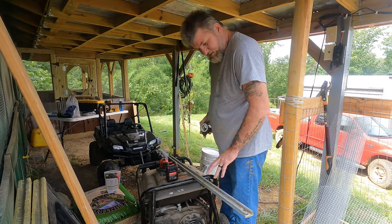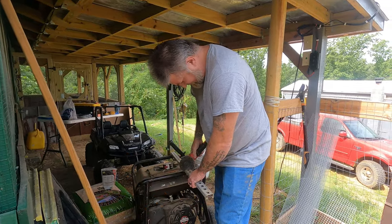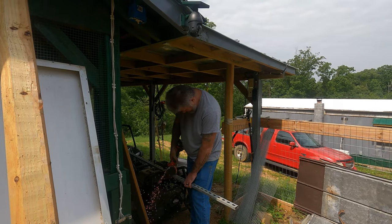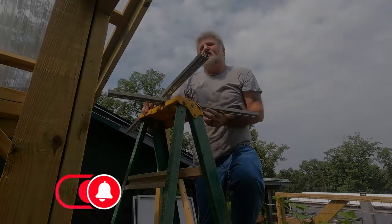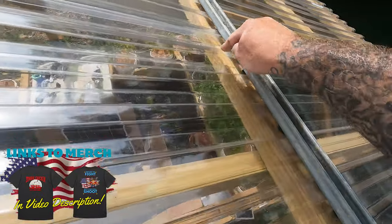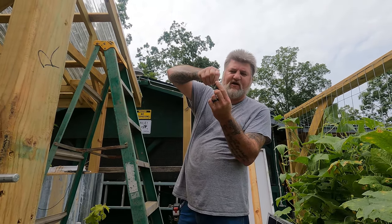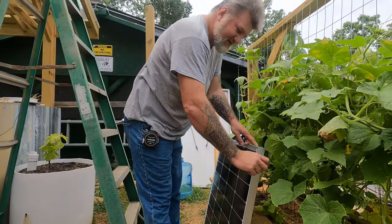I'm going to cut two more pieces of this unistrut, 32 inches long. I do recommend glasses. I mount the unistrut the same way — roofing sheet metal screws with a big fender washer, right directly on top of this. I didn't tighten it so tight that it squished the plastic, but it's definitely on there really good — it's not going anywhere. Basically just a little fitting that goes in the unistrut; you turn them and they lock into place. It's a threaded quarter-inch bolt, two inches long with a fender washer. You put your solar panel in here and just pinch it down — that's all it does.